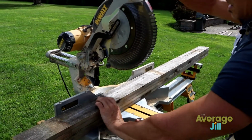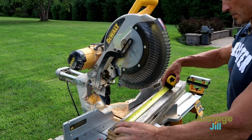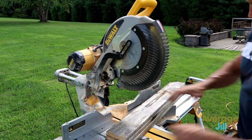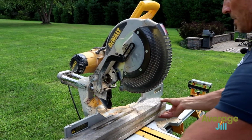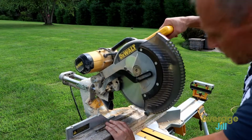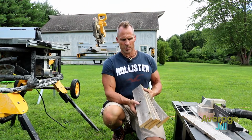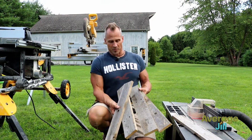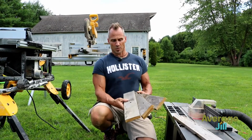Slide it in. We're not worrying about squareness here because some rot there, but that's okay. It gives it character. This is all just rough stuff. We don't need to try to be absolutely accurate here. What I did was, because we're doing 12x12 frames, we need 4 pieces to do the frame. I cut these pieces roughly at 20 inches each so that they're a little bit longer.